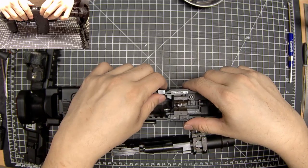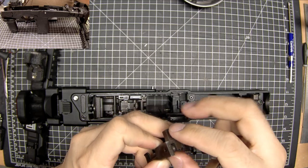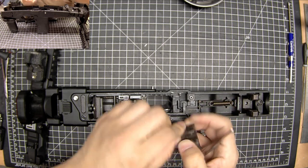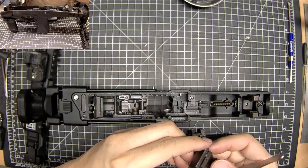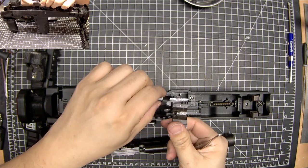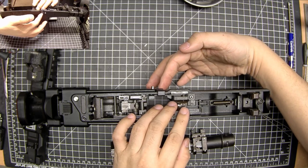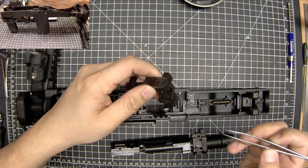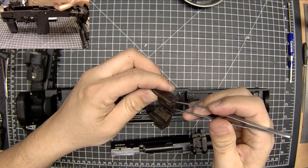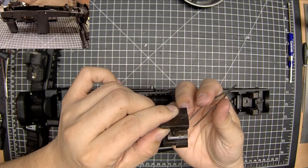More problems: I was also finding that when I reassembled this I'm going to try and replicate it — the bolt lock wasn't quite right. The bolt lock was far too resistant. Effectively, the spring in the magazine pushing up wasn't enough to overcome the force of this spring. What had happened was there's a spring responsible for this action and the other end of this coiled spring had protruded slightly — it was slightly proud of this surface.